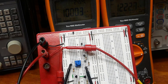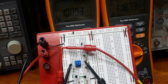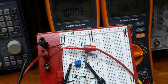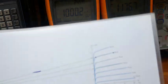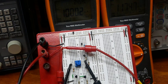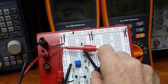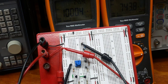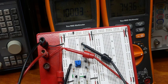Now let's look at the compliance of the circuit — how much does it change as I change the load voltage? You notice that the current is going down, and that's because we've got less VCE. So we're going down on that slope on the collector-to-emitter curve. As I go to the next point, it continues to drop, and at the next point I'll probably be out of the compliance range. If we were looking at a tolerance of 10% or 15%, we're already about 26–27% low there.